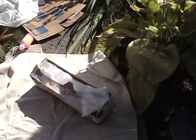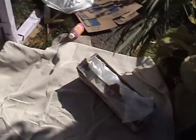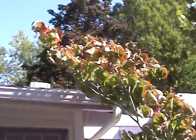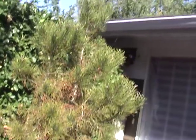So then we use the drop cloth and put it underneath or over the top of the plastic for up here. Now I use a 10-ounce drop cloth. You can use any kind, but these are the best. They soak up a lot of paint, but I don't spill that much paint. All right, now I'm going to get the base color, and I'm going to do the front of this and finish this job. But I wanted to show you that is how you tape a door or a window for coverage.